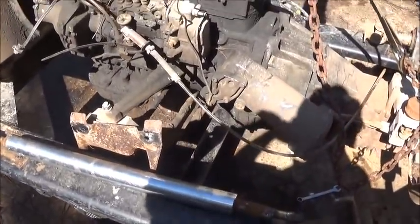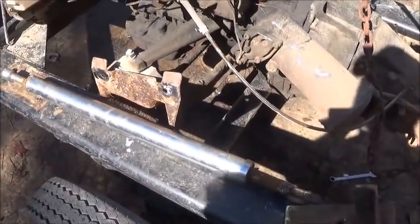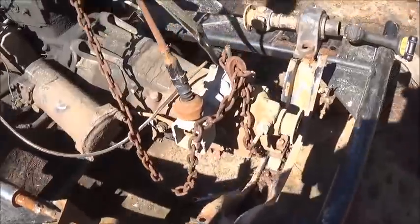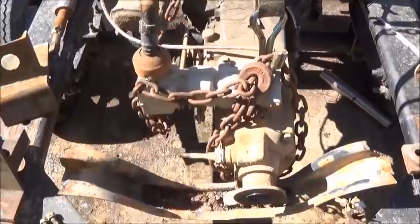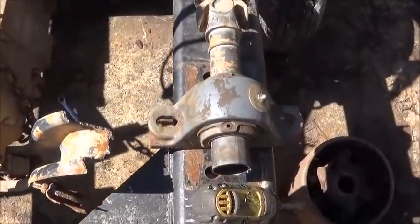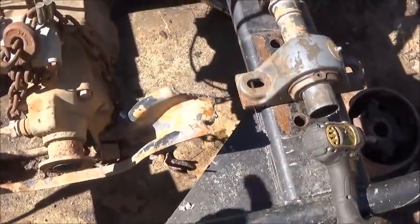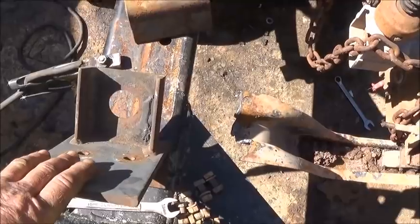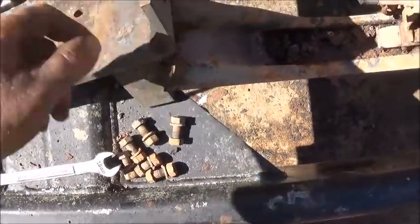Here's where we are: I pulled the crossmember off the engine, then mounted the crossmember where I thought the height needed to be. I've just got it spotted in — welded but not permanent — so we got that part taken care of. It offsets the engine over to the side, but I don't mind that because the radiator is offset to the side too, so that'll make the radiator line up straight. The transmission is going to be offset over here, which is not an issue. What we're doing now is we've got our bearing on our shaft — we're going to turn out a solid piece that slides up inside and fits our belt pulley. We've got these brackets which came off the 4500 ambulance that I turned into a rollback.